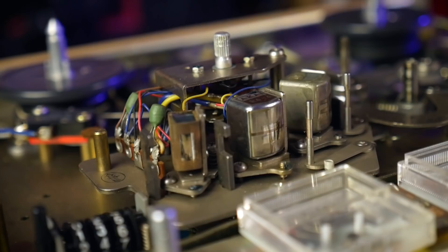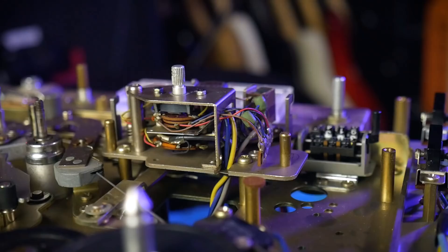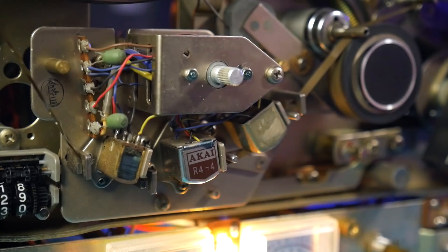I still have some work to do on this. The track selector switch, which determines onto which lines of the tape the audio will be recorded, is very temperamental and does need to be replaced. Upon inspection internally this is housed in a frame which would require some dismantling of the mechanism to remove, and there are about 100 thin wires approaching their 50th year that would need to be carefully desoldered and reattached in the correct arrangement on a new compatible switch. I've decided it might not be worth the risk, since this device does work in mono, which is all I need to use it as a guitar echo effect.